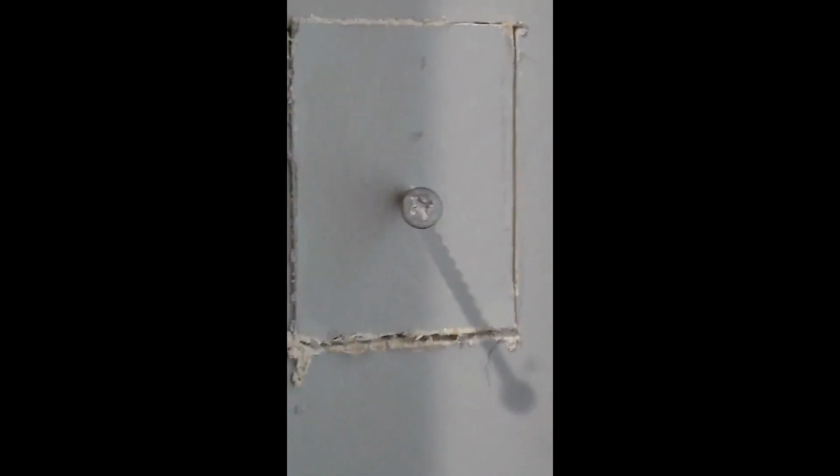So what I done was I took a wood screw, or a drywall screw, kind of flattened the end of it, which will make it hard to start it into the drywall. Now I'm going to just take a screwdriver and screw that screw in, and with that backing behind that should force that piece out of there. There it comes. You can see it lifting out. Now when I get it so far out, I'll just take the screw and pull right out.